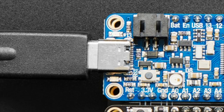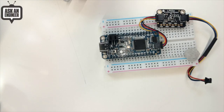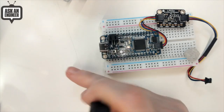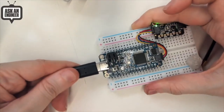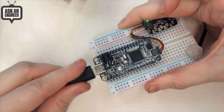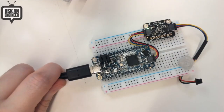These are very nice low-cost connectors — not designed for DisplayPort or Thunderbolt, just for USB data and power. You can see them here with our STM32 F405 Feather, which was the first board we used USB-C with. We have a huge guide on learn.adafruit.com all about USB-C — we looked for a resource out there and couldn't find one. We also have an article coming out in 2600 soon. There are things like alternate mode, cable length, and different types — 3.2 rev 2 gen 2 — lots of things to know.